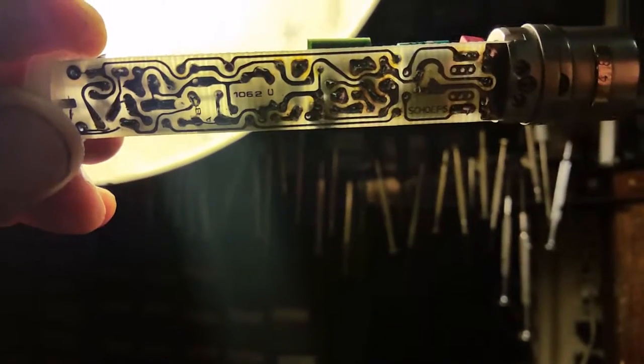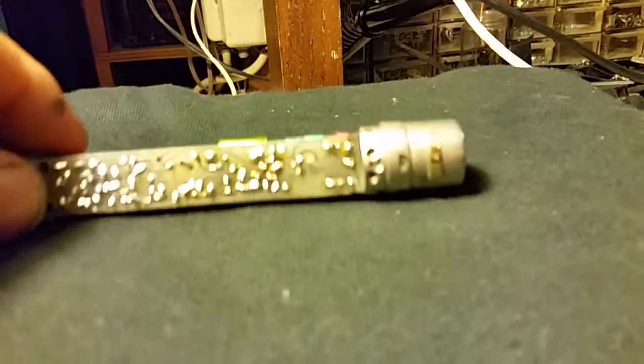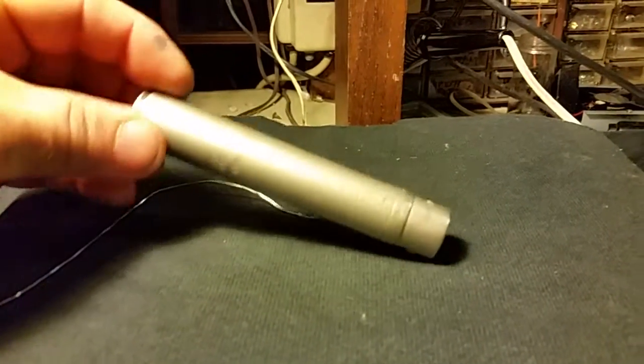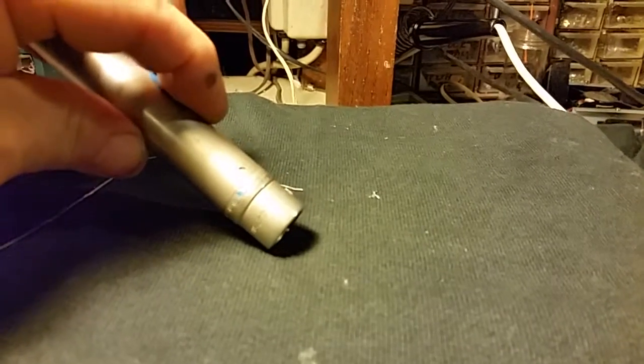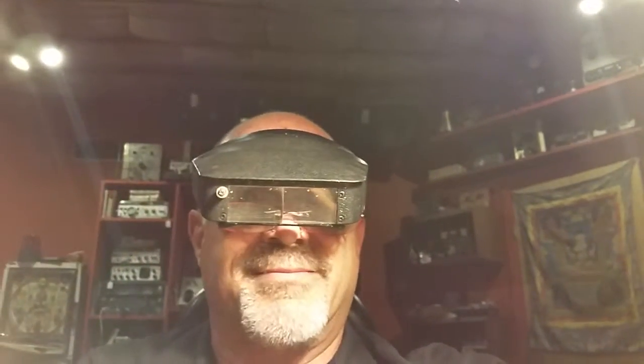See that nice little bridge I made? I went from the B and I crossed to the A — that's how you do it. Once you're done with that, you reassemble your microphone and test it. You have gained about 5 dB of amplifier gain and made it a blue dot. And if you don't already have the blue dot on your microphone, you can get yourself a little enamel paint and fill that in there. It also helps to have magnifiers.